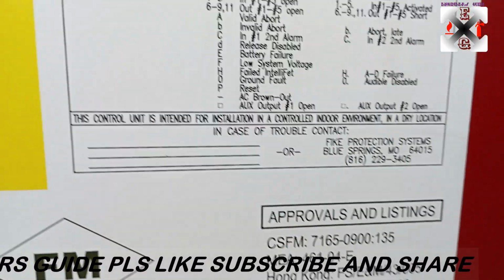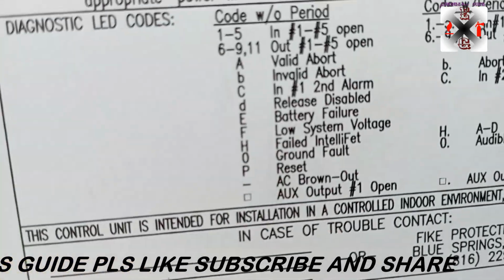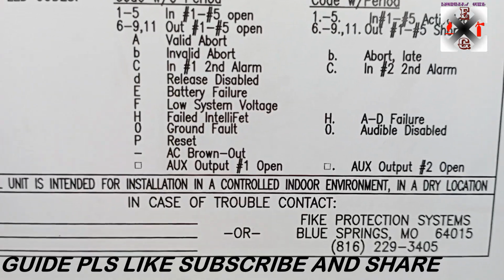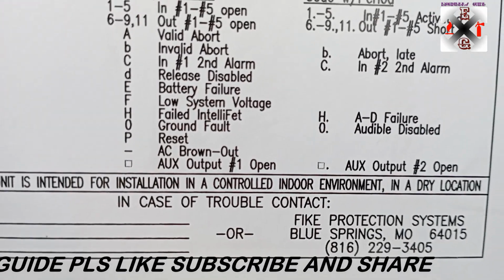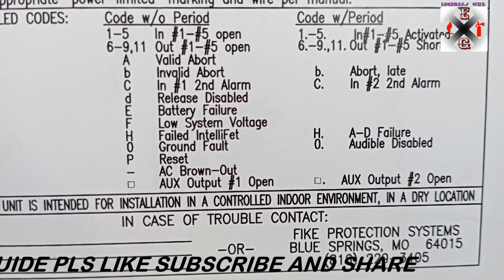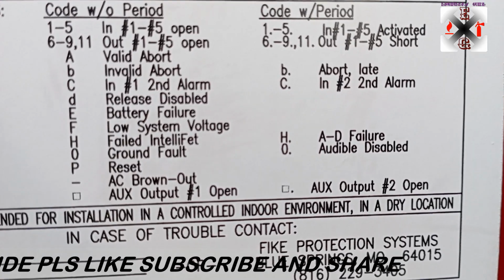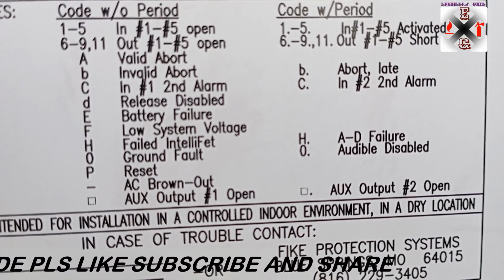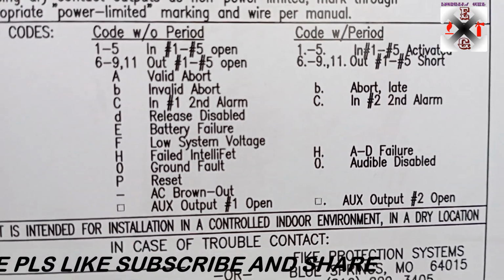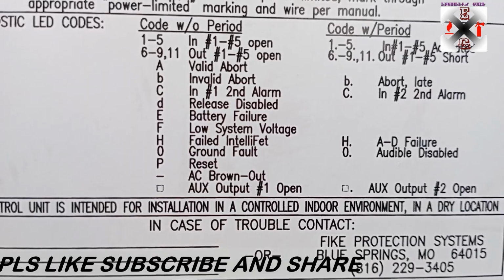Okay, what if you come and you will see 0 showing on the panel? So when you come and you see 0 showing on the panel, it means it's what? Ground fault. And how to troubleshoot ground fault also I will show you. And in case you see B, it says it's invalid abort. When you press abort when there is no any activation, okay, it will be showing B.